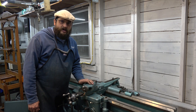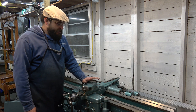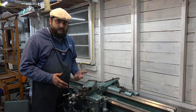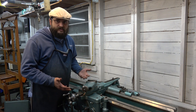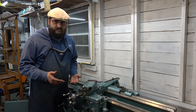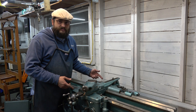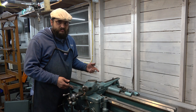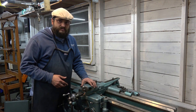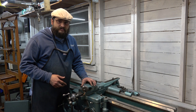The taper attachment is now installed, but here's where we're going to run into a bit of an issue, and it's actually very disappointing. Let me explain what has happened. At some point in the history of this lathe it has been worked on — we've discussed this in the past. The cross slide screw is, from what I can tell, not the original. The original screw would have a telescoping feature.